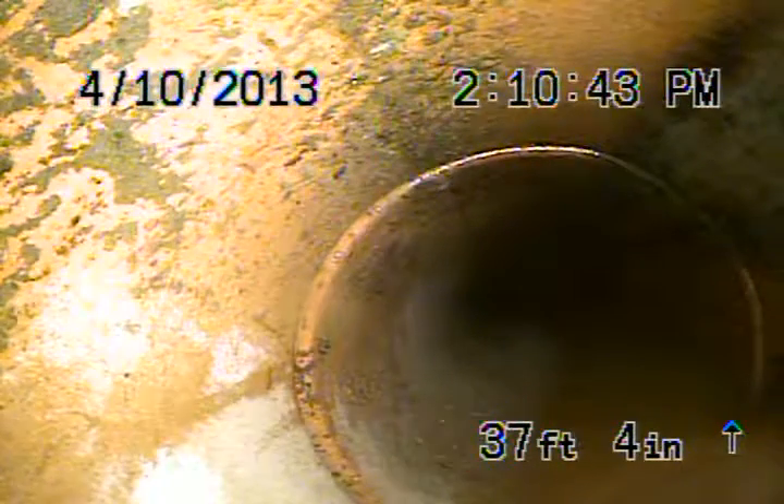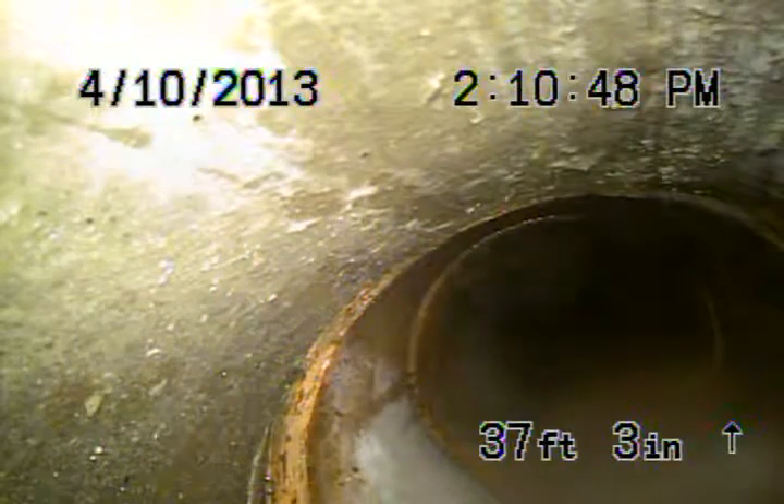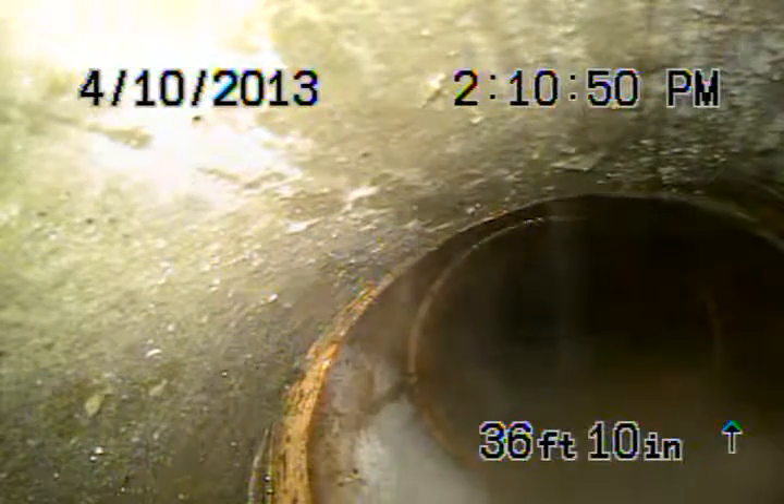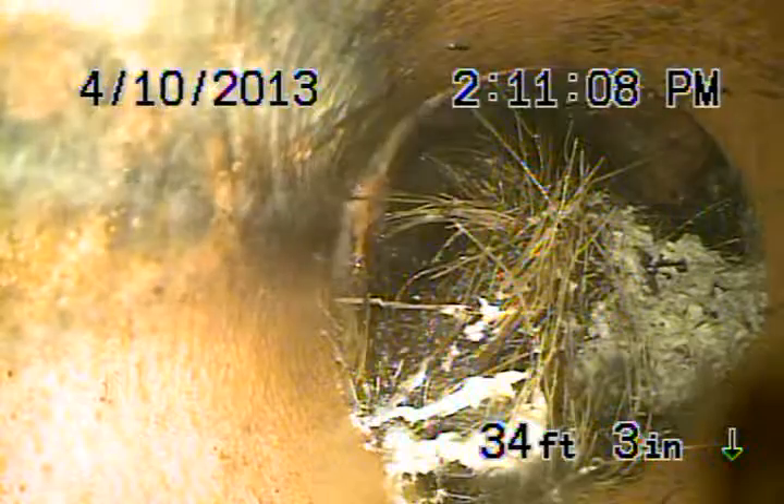It's transitioning from 6-inch clay to 4-inch. Now we're coming onto the property. We located this approximately about 6 feet deep underneath the ground, just where the shrubs are, the front bushes. As I come back onto the property, you're going to see heavy roots here. You can see it's closing up the whole line, just a little bit of space coming through the bottom of the pipe. Heavy roots. This is approximately about 6 feet deep out there in the front yard. We marked it with white paint.